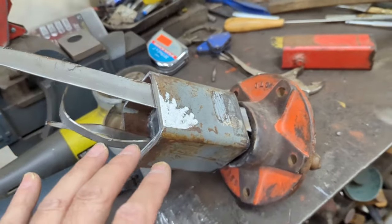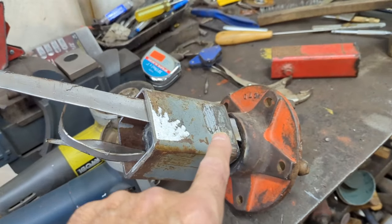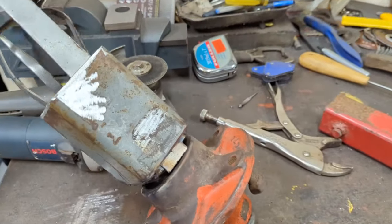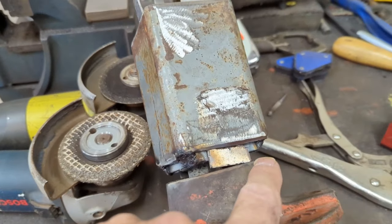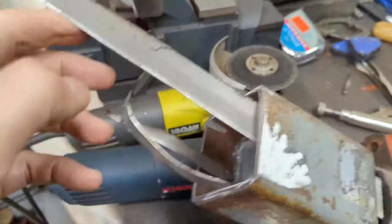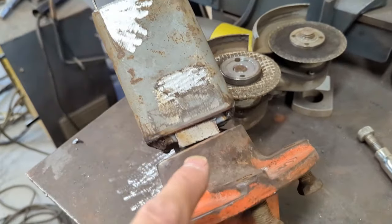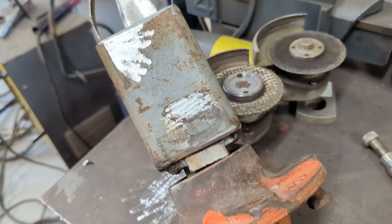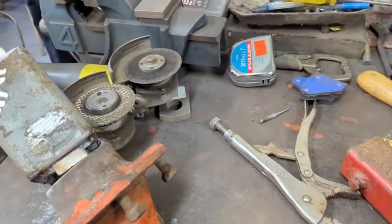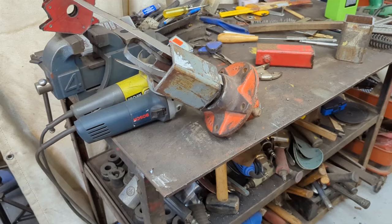As you can see, there are some shims. I encountered that it was loose in there, so scraps of 18 gauge went in — it's even all the way around now. That'll keep the pivot point even, and I tacked the corners together. I'm going to tack inside on the corners and then remove the shims, and then weld the bead right across. You can see I left a lip to weld to, and I beveled the edge of the three inch a little bit. That whole apparatus is only about four and a half inches, which gave me lots of room for the hub — I think the hub gives me five and three quarter or so. I'm still within the ten and a half.